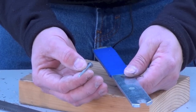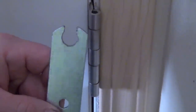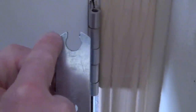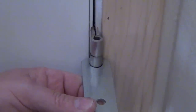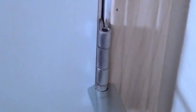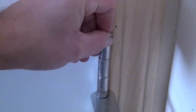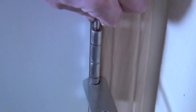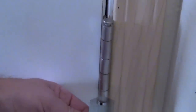The key is to remember this profile — it's the same shape as that hinge. Come in closer and see how I'm fitting it over the top. I'm coming to the first knuckle, knuckle, knuckle, then pushing over. You go to the second knuckle and start to push over, but you put the pin in and make sure you push the pin in as you're aligning. Then when it's just right, push the pin all the way back in and check your door.